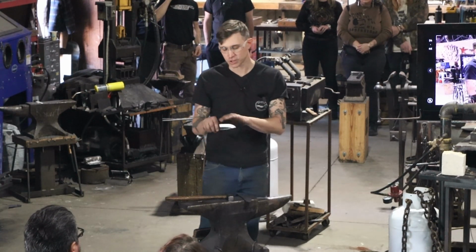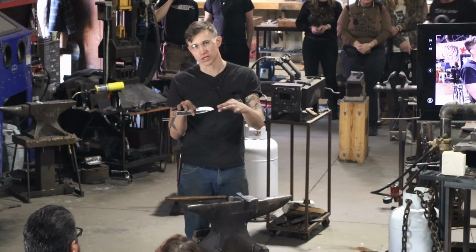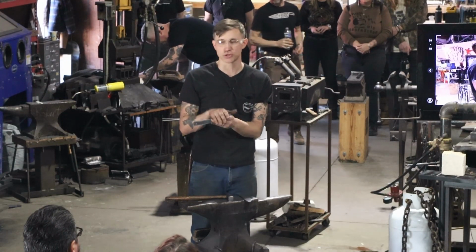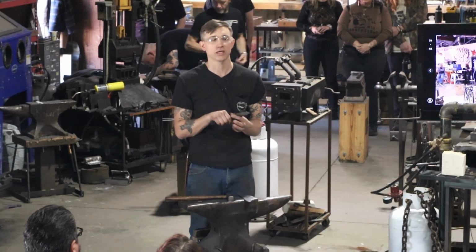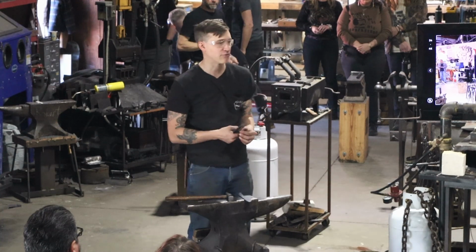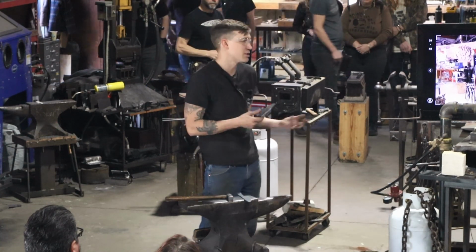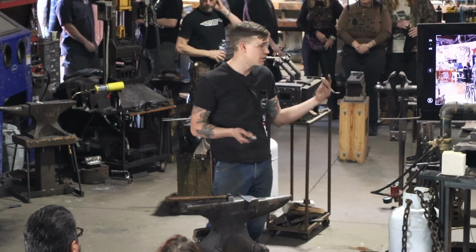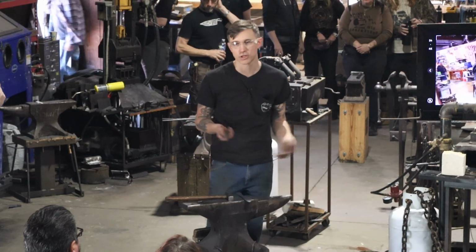The final thing, the surface conditioning, when I'm getting up into that 220, even on a bushcraft or a bigger knife, I want to get my edge pretty thin. A knife's just not going to be a cutter if it's big and fat right behind the cutting edge. It's just going to be hard to sharpen. You're going to take a lot of steel off. Sure, it'll be durable, but I mean, a railroad spike's durable. You know, if you need a pry bar.